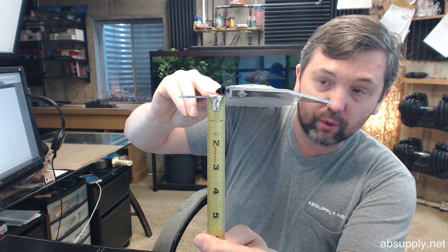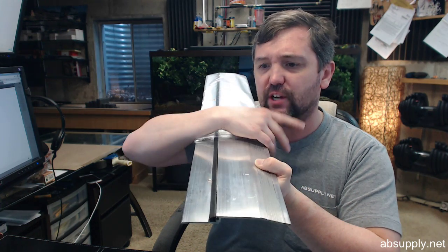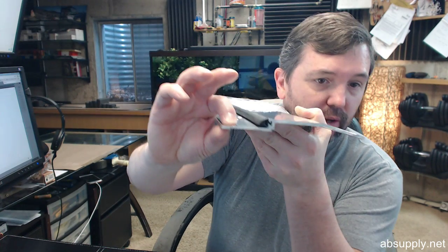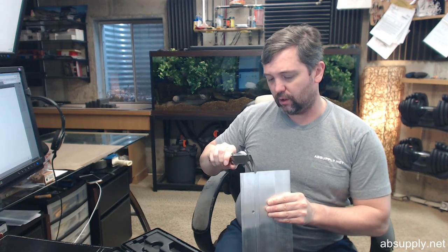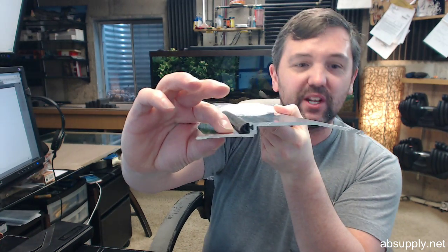And then you have down here what's a 1/4 inch between the floor and the top of this base. No, forgive me. Actually, that dimension is not given hard. It's probably closer to 3/16 would be a closer dimension, if even that. The drawing as I study it doesn't show that. It would be very helpful to know how high that dimension is. Yeah, it's actually 1/8 of an inch. Well, it is drawn there, that's for sure. Forgive me, it's a bit small for me to see. It's 1/8 of an inch lip height here.